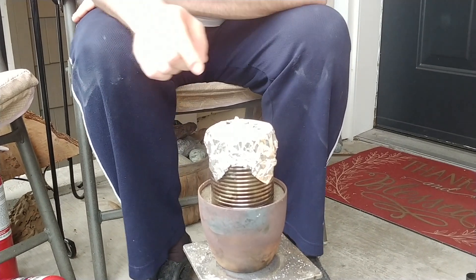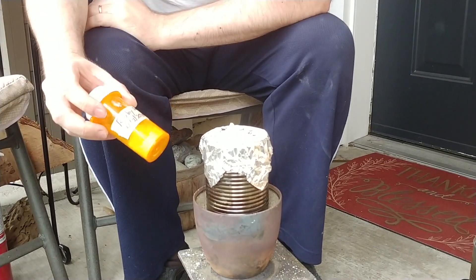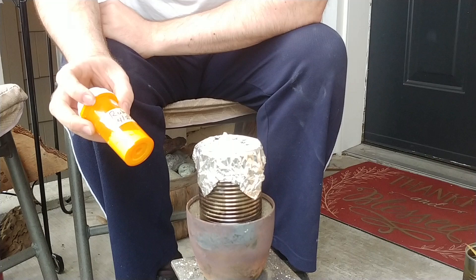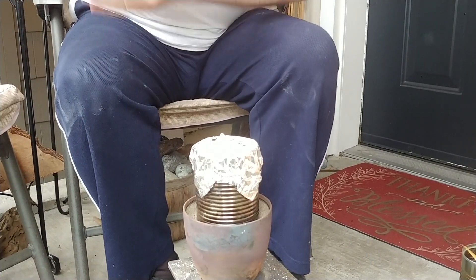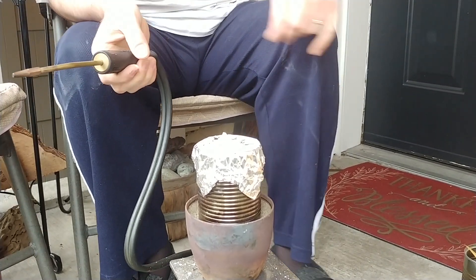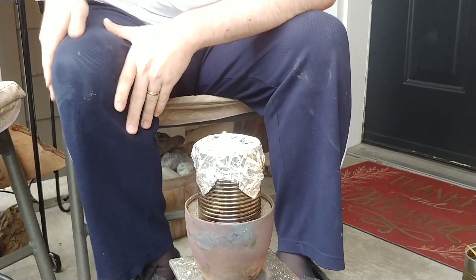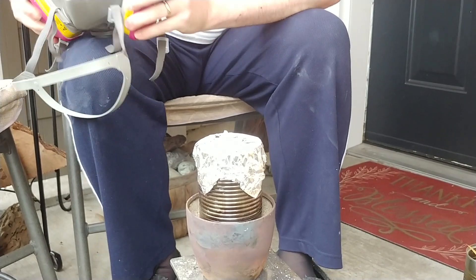Anyway, what I'm going to do here is I've made a nice little cone out of my ruby mix. This is batch 4. It's like 97% aluminum oxide and 3% chromium 3 oxide. So it looks fairly light, but it does come out with a really nice red. Right now I'm still using MAPP fuel and oxygen, so it's just going to have to do until I get more stuff set up for my Verneuil furnace.